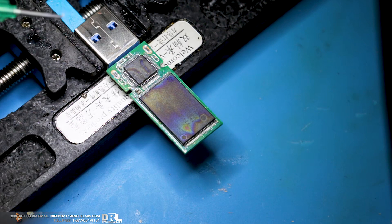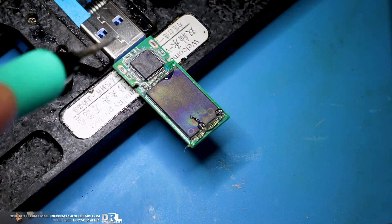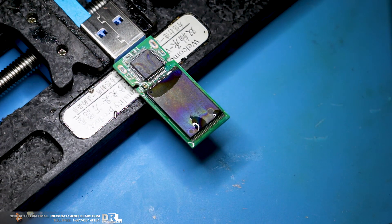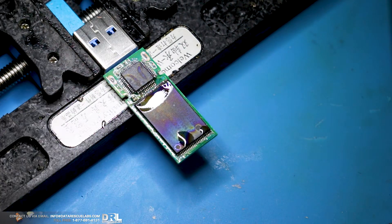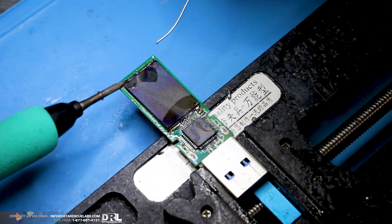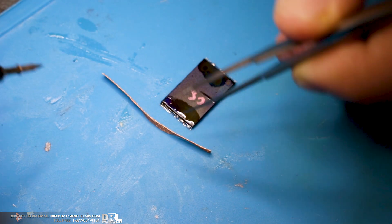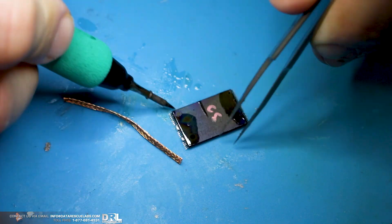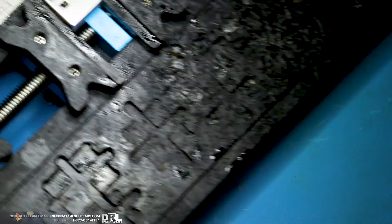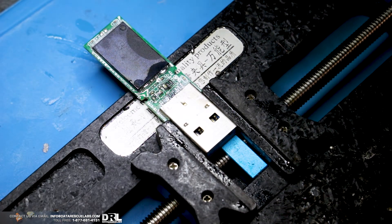All we have to do now is remove the NANDs and the controller from the original drive - this is the one that's bad. I sped this up because my soldering was horrendous on here. The solder didn't even want to stick to any of the pads, and that was from the corrosion. This is the best way to remove TSOP because you want to avoid the heat - you heat up the sides with a lot of solder, put tons of solder on one side, and then lift it by heating it up. This way you avoid heating the entire chip. Here's the first chip.